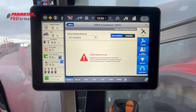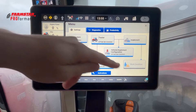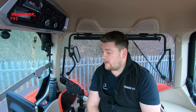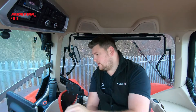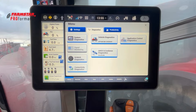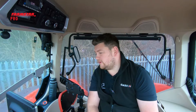Going down one more brings us into the GNSS and guidance settings page, where we can see all the vehicle measurements, calibrations, and things to do with guidance work conditions. Across the bottom is more ISOBUS-related; it's grayed out because we haven't got an implement selected, but if you were setting up metering systems on a drill via ISOBUS, you'd set up the controller there for task controller functions like shutting the drill off on headlands. Activations takes you to where you can unlock parts of the display; Diagnostics covers the diagnostic side of the tractor; and Productivity covers reports and totals for jobs and implement jobs.